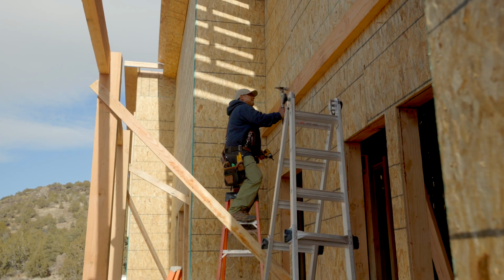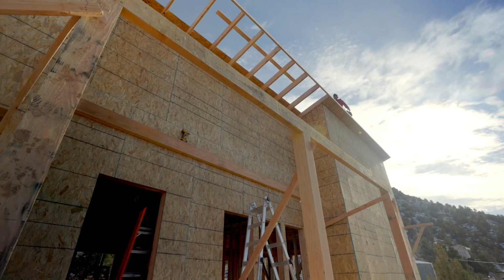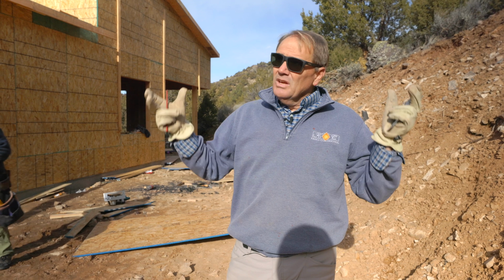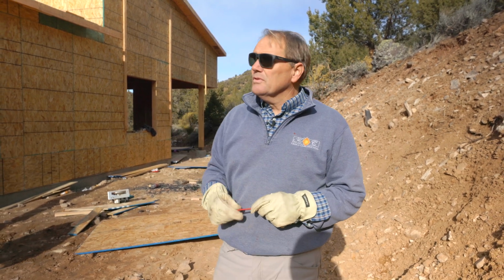You're going to push to race through that to try to get your house framed in so you can dry it in. And dry in is where you have your synthetic. You put it over the roof and it's protected, and if it rains or snows, it's not going to get inside the home for the most part, other than venting and stuff that goes through the roof.